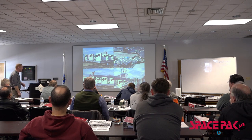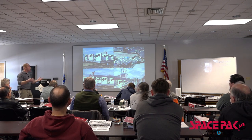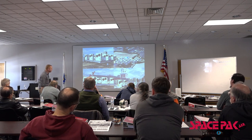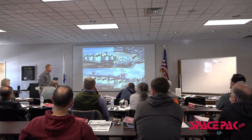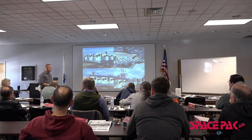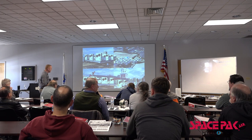Some bigger projects like that, look at the redundancy available on some of these units. And again, why would we do something like that? In this particular application, they were in banks of a certain amount. Instead of having multiple big chillers, it gave the redundancy. So even if there was an issue with one, the other ones were there to take over. We've been getting a lot of traction on these.